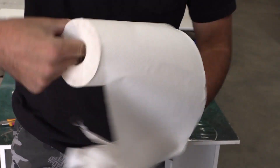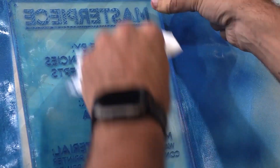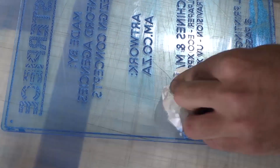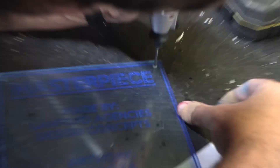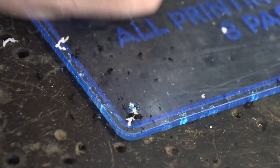Once it's finished engraving, we'd like to try spray painting the back where it's been engraved. Remember it's mirrored, because I want the engraving on the inside of the certificate so you can't touch it or get dirt in it. The idea is to put a light spray-painted layer over the engraving, then quickly wipe it off with methylated spirits on a cloth — you should have color in the actual engraved pieces, looking like an inlay. Make sure you only use methylated spirits, as thinners, alcohol, or paint strippers will turn the perspex opaque by damaging the top surface.